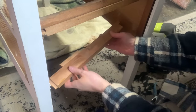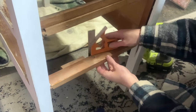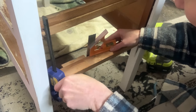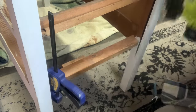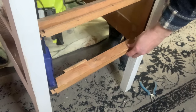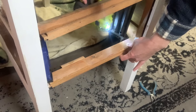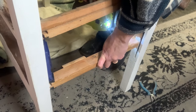Now that I've got that cut, I'm going to try and fit it in here. The back was already notched out so I didn't have to worry about that. The front, we just did those two notches to fit in the groove there. I'm just going to make sure it is level. This part was a little bit difficult because the carcass isn't supported right now on this side — there's nothing holding it together, so it kept wanting to slide out. That's why I'm using a clamp to get it on there. I'll have to make sure it's re-leveled, and it was kind of a pain until I realized I should probably clamp the whole piece together while I'm trying to work on it. Bonus tip for you in case you're having a dumb moment like I was.